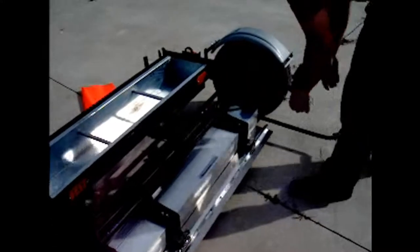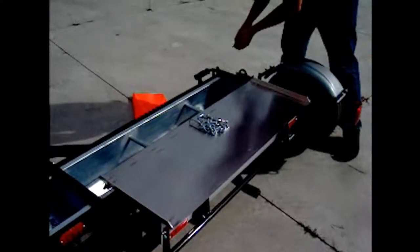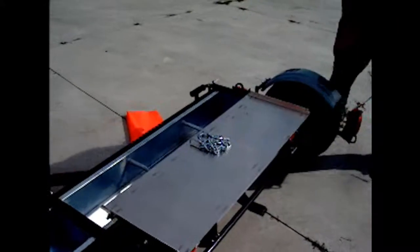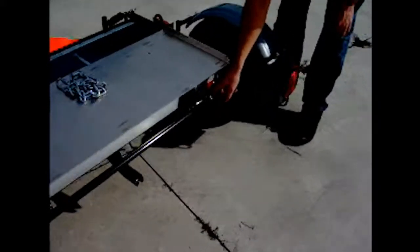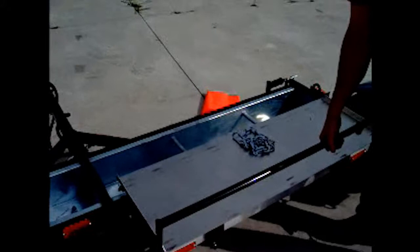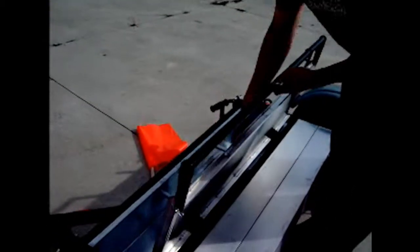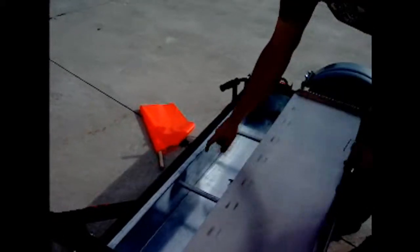You remove the clip and flip the magnet back up into its towing position. Reinstall your clip before you clean the magnet off. This secondary clip in the bottom right here — you want to remove this. This is your debris stripping tray. This handle just pulls out so you can get a little more leverage, and you just lift this up. Your metal debris falls forward into your debris pans.